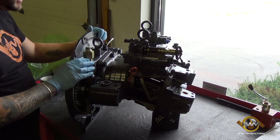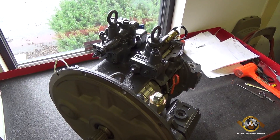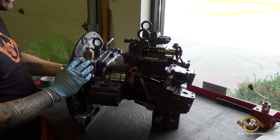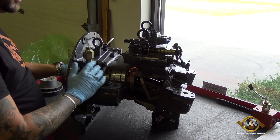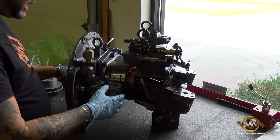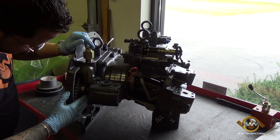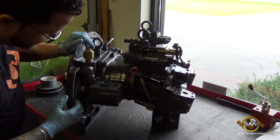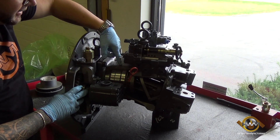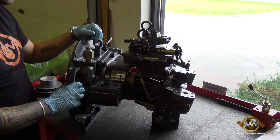Primarily in this area is going to do the majority of your driving. On the front shaft you're going to have a coupling that attaches to the engine itself inside of a bell housing. It dampens that initial startup and absorbs some of that energy so the pump doesn't drive directly off the energy source. There's a pilot pump here, connected to the shaft and driven off the main gears. Inside this housing, a primary shaft comes from P1 and as it goes to P2 it transfers through those gears so both pumps work in unison.